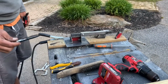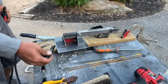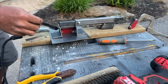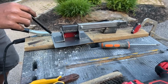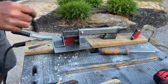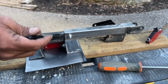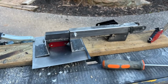We're approaching the final stages. I've disconnected the arm from the assembly, basically cut a 6x6 plate to mount the TV. I've used L-channels to act as the hinge. Now, they're not cut to size because they're going to get trimmed down. Once I tack weld them to the actual flat plate, then I'll trim them back so they'll be a lot smaller just to act as a hinge. I've already gone ahead and added the telescoping piece, drilled a hole on the outside tube. I've only put a single hole on the inside, but this will be where I can put multiple holes going up inside so that I can raise or lower the TV once it's completely out.